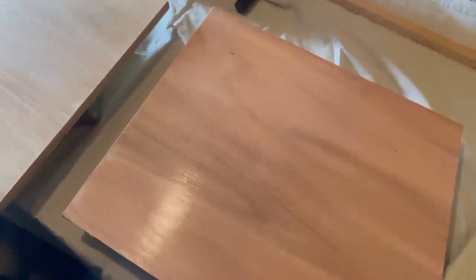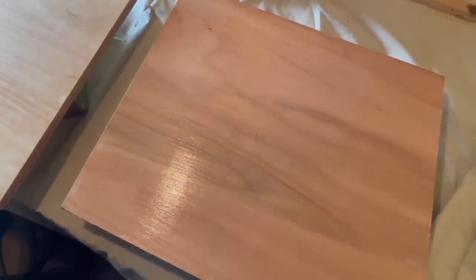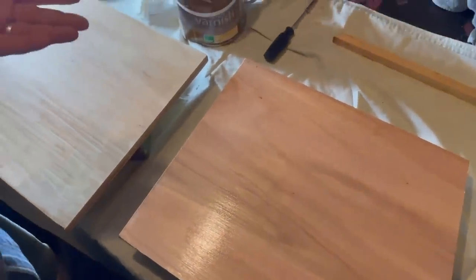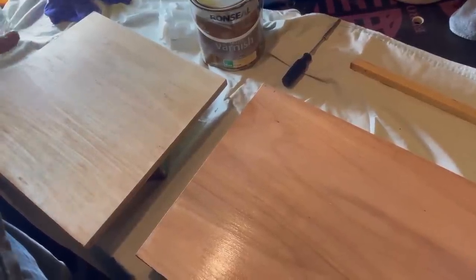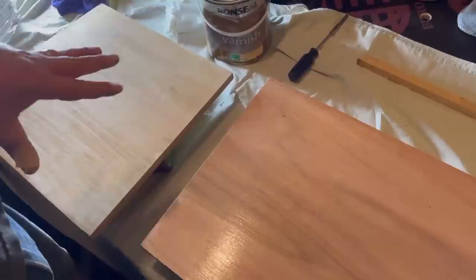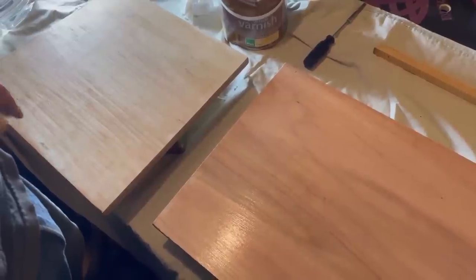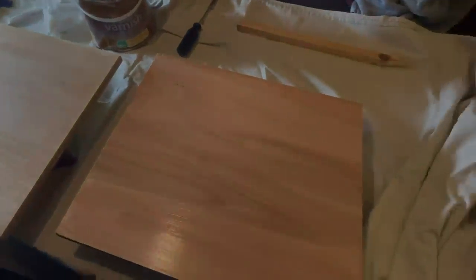So Michael's just done a layer of varnish on the two panels that are going underneath the well deck. They'll get painted on the other side and they'll go on top of steel that's painted. So it's just a little extra. These are actually the bottom and they'll go against the steel that's got bilge paint on it. And then they'll be fixed down with some silicone adhesive, probably Stick-All. So really the varnish is just acting as a sort of last line of defense, because it's marine ply, it's fine. Yeah, it's actual marine ply. We thought we'd do it with regular plywood, but it turned out that Andrew had some offcuts of marine ply. So bonus. Okay, let's call it.